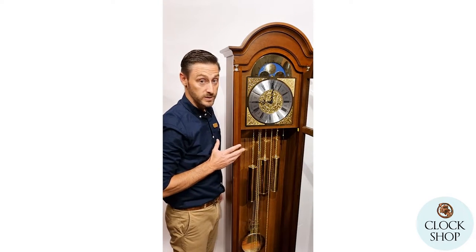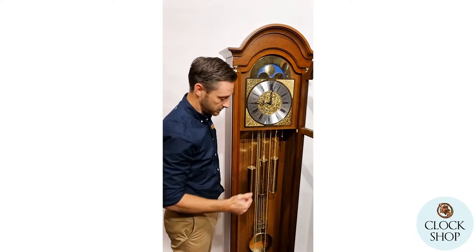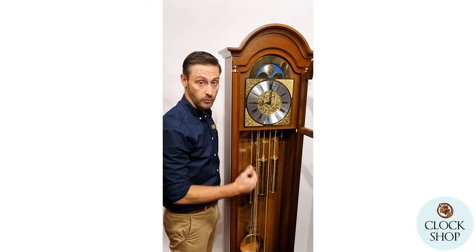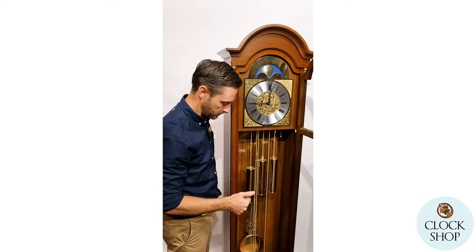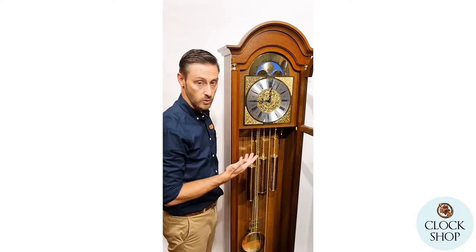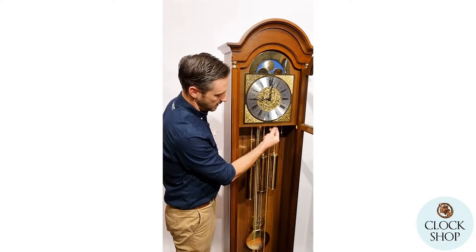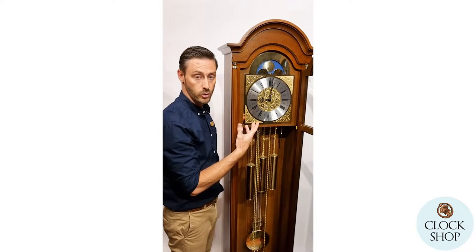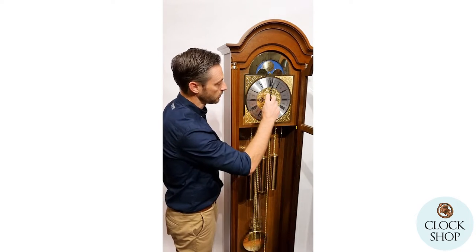The clock is fitted with a couple of great features. One is the automatic beat adjustment — that means you can give the pendulum a nice wide swing and the clock will find its own level position, so you don't have to have the case perfectly level, though you need to get it fairly close. The other feature is the automatic night off option. This lever underneath, when pushed up, puts it into automatic night off mode — the clock automatically stops chiming after 9:45 and resumes at 7 o'clock in the morning.